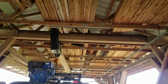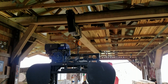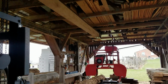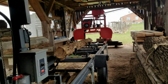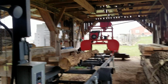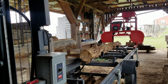Those are big ash beams up there with steel angles on the top, steel rollers that roll that thing, and then it's a hard maple, sugar maple, that is the main beam that the trolley goes back and forth on. And I've picked up more than the capacity of the crane, which is 1 ton, and I'm sure I've had logs on there that it really struggled with and took everything I could to lift it up, just enough to roll it over on some of these bigger logs, and it had no problem. The capacity of this particular mill, it'll cut a 25-inch wide board, and you can start out with a log, by the time you whittle it down, 30-inch diameter, or at minimum by 21 foot long. So it's got pretty good capacity.